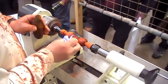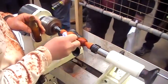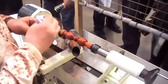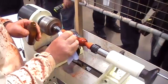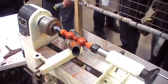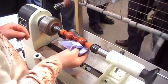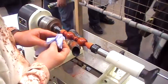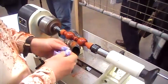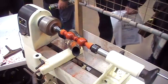If you've got a big bottle of friction polish on the lathe end you're knocking it off and wasting a load — decanting into small bottles saves a lot of money. I've sanding sealed it and now I'm just applying friction polish just to seal it really. There's the polish onto there; polish it up with the paper just to get the residue off and to get the grain sealed more than anything, so it stays clean. Once you've got that dried off with the paper, I want no residue coming off — it all needs to be nice and dry.